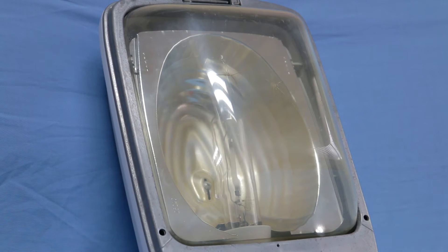Here's a close-up of the optics. It's got a polycarbonate bowl which has suffered some damage over the years — it's gone slightly yellow and there are a few cracks in it, but nothing too much to worry about. You can see the reflector in the top corners and the screw in the middle, which can be repositioned so the beam can be changed — for example, if it was mounted on a short or long outreach arm, the spread of light can be controlled.